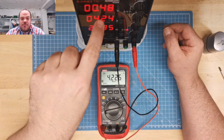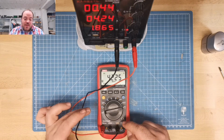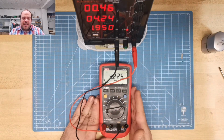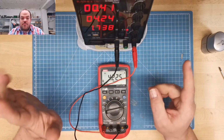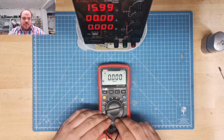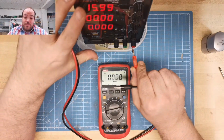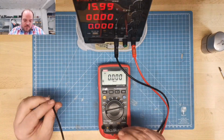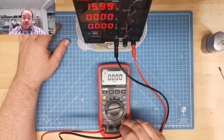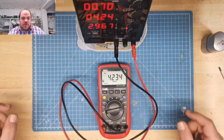And at 0.48, also at 480 millivolt, that is the drop through the leads and the drop through the shunt in the multimeter. We get this, we're dissipating about 2 watt of energy into the meter and the cables. They didn't get warm. And you see my cables are still not the best, so I still should get other cables. This is more beefy. But also here, the contacts are still not so good. You don't see this. It's live. Oh, it's even worse. Okay, the cable is longer. 500 millivolt, about 3 watt.